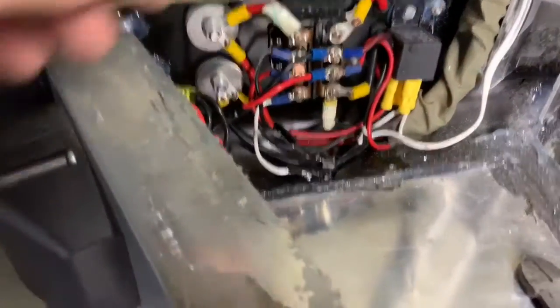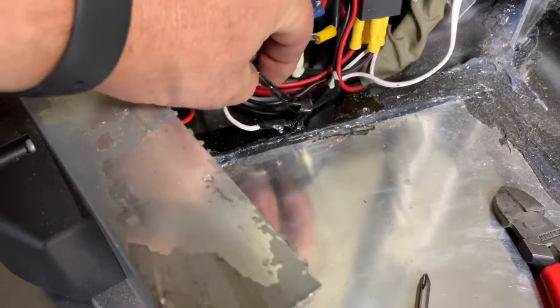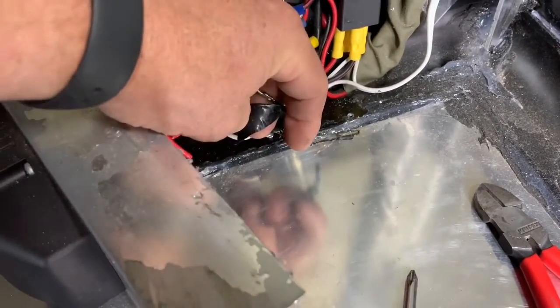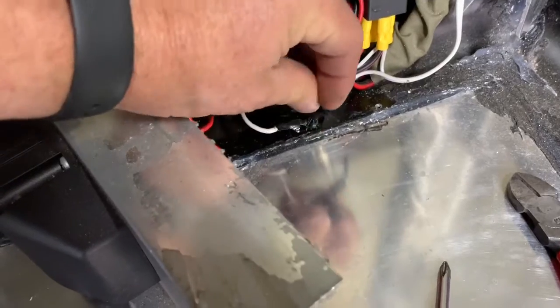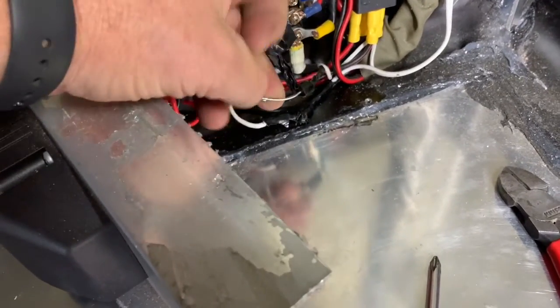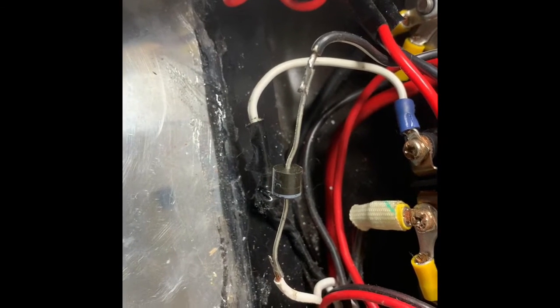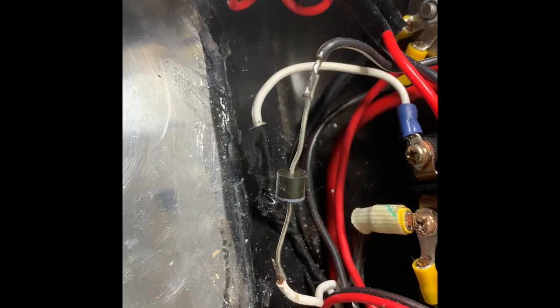To replace the diodes I'm going to unwrap the sticky tape and then cut out the faulty diode. I'm one-handed so I'll put the camera down and show you once I've cut the diode off. Here's the first diode unwrapped — I've taken the sticky tape off. You'll see it looks quite good, it looks intact. It probably is, but we don't just change one, we change them both.